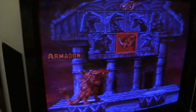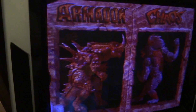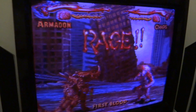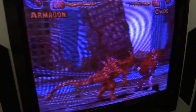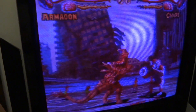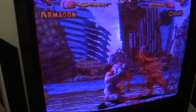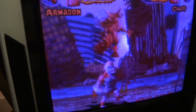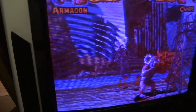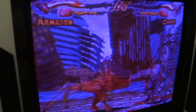What I'm guessing is I'm going to have to replace that IC — the 7406 — just to get this thing working correctly. But yeah, it's not bad. I'm pretty pleased considering the size of this board. I was going everywhere looking for bad traces and all sorts of wild stuff just to try and get this thing to work, and yeah — we've got video.